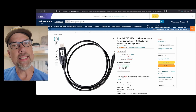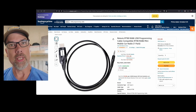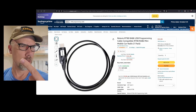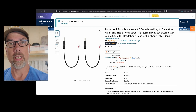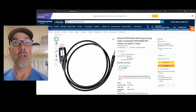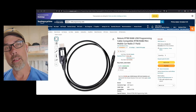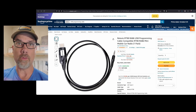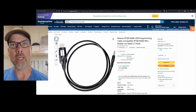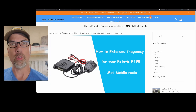One of the drawbacks of having this little teeny tiny radio is that there isn't any way to enter any frequencies into the radio itself. You need to program this thing. You need to get one of these programming cables or be handy enough to build one — an FTDI USB interface and a TRS tip-ring-sleeve connector will make this a happy day for you. This will also get you audio out of the back of the radio. But in order to do data modes with this, you need to cut the cord on the front to get PTT signal and audio data into the radio to get it out over the airwaves. This is also the same cable you're going to need to do the frequency unlock that I'm going to show you here, and there will be a link in the description down below.